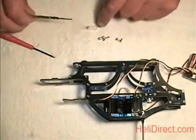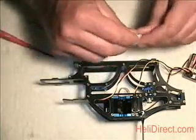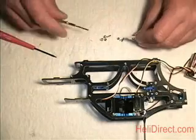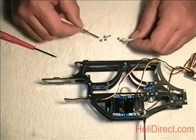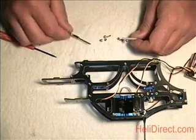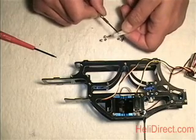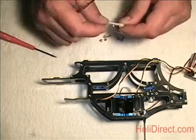In this segment we're going to put balls on our servo arms. I've already got the servo arm taken off. Do them one at a time or mark them — remember we 90'd everything, so make sure you get the arms back on the right servos. The kit does not come with balls for the servos, so you'll have to buy a set of Align balls. I recommend the pack with steel balls rather than aluminum, though aluminum is cheaper. Use nuts to back your balls and Loctite them.